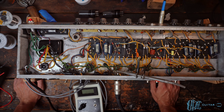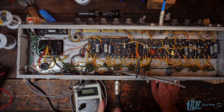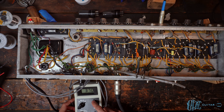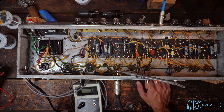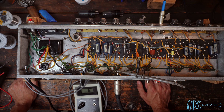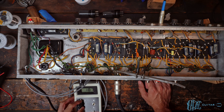So this amp's interesting. I've already done a little bit of a test ahead of time just to see the gap between biasing my normal way versus getting rid of the knee with this set of new TAD SCR tubes. So I want to go ahead and record that and take you guys along for the ride. The amp is on right now. Let's check the bias. We are at 435 volts for the plate voltage and the milliamps plate current right around 18. That's right around 60% or so, which is basically exactly what I personally go for in my Fender amps. So this amp is biased perfectly based off of the bias probe, and we can see the tubes are matched very closely.